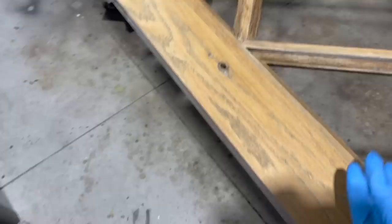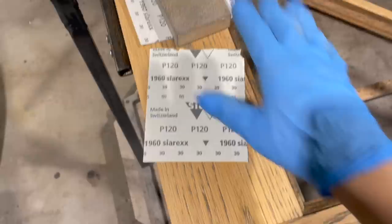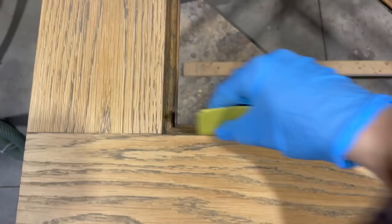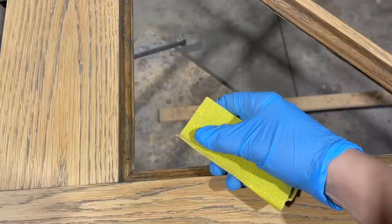And so I've got all the surfaces done with the sanding machine, but we need to just straighten out the grain with some hand sandpaper. So I am going to be going over all the straight surfaces with the block and this. And then for all of you who are like, how are we going to sand the profiles? I'm sorry I don't have any easy answers for you, but it's just this. And you can buy a lot of profile help, little pieces of foam that are shaped in different sizes and shapes, but really you'd be changing those out constantly and it would waste more time.